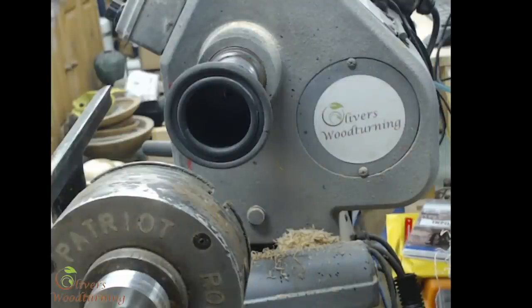And I bought a sandblaster a while ago. Anyway, the little Bambi, or the big Bambi, doesn't put out enough CFMs, pressure out. Puts out about 1 CFM per pot, so 2 CFMs. It didn't do anything with the sandblaster, forget it. So I then used my noisy compressor, because I hadn't got rid of it. And it weren't all that successful, if I'm honest. And I thought, well, this is rubbish, really. You know, I'll get rid of the sandblaster.